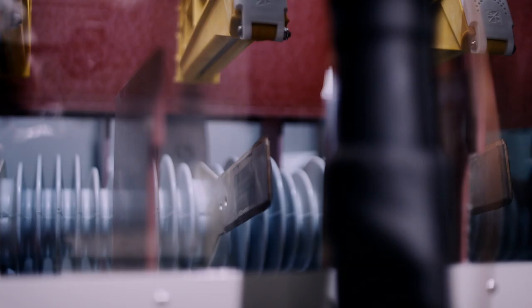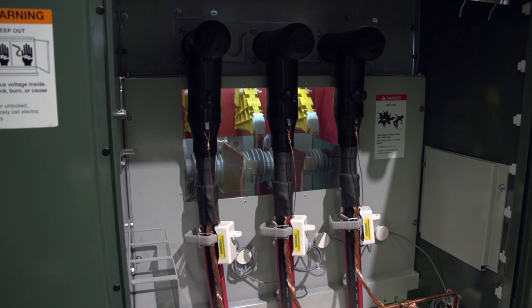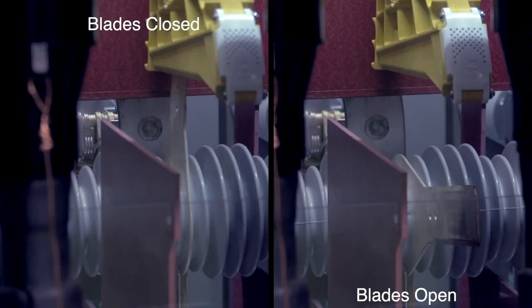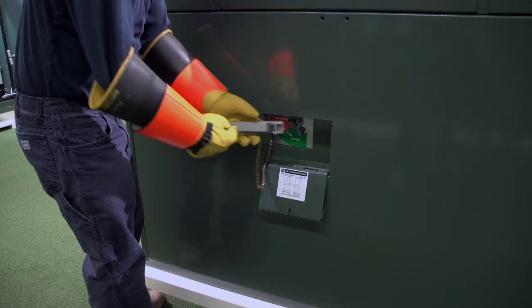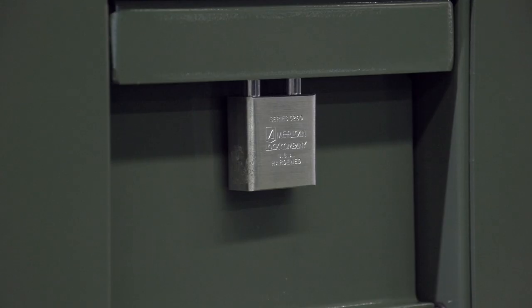You can now confirm the open-close position of the mini-ruptor by observing the blades. A viewing window is provided in the switch termination compartment to allow positive visual verification of switch blade position. Here they are in the closed and open positions. Remove and fold the switch operating handle and return it to its storage position. Then close and padlock the access cover.